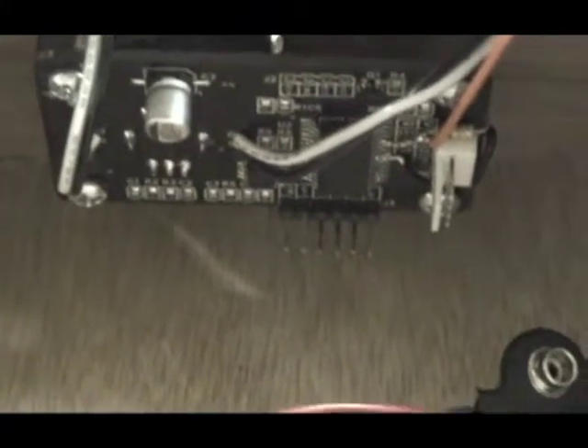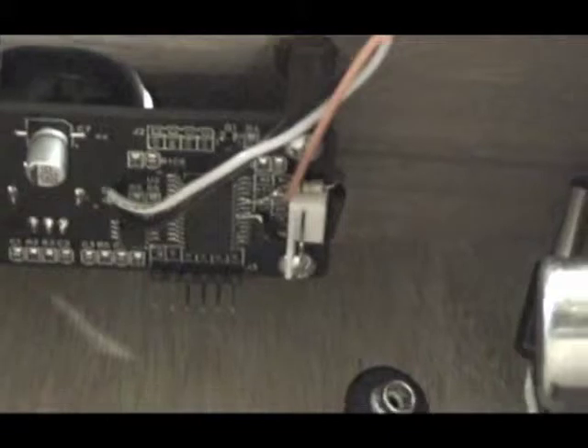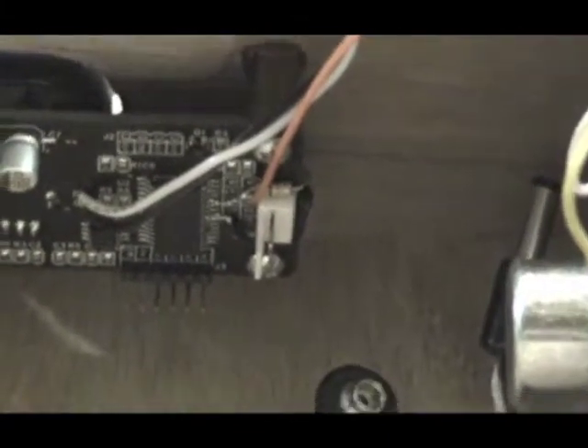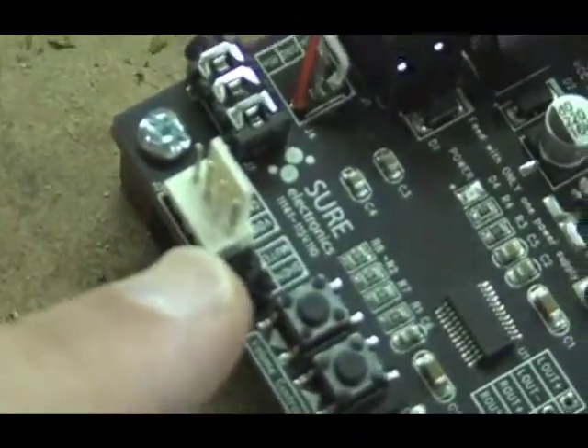But I made a modification that you can barely see. See that little resistor right up there? That takes one of the extra lines off of the little microprocessor chip on that board and provides me with a mute line — that's that orange wire. That's the mute wire, and that wire connects up to the black header that I installed right there.